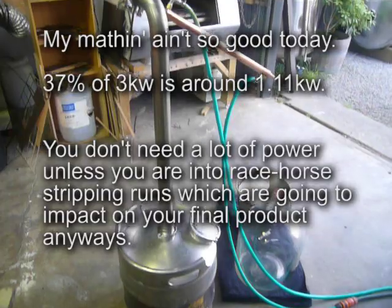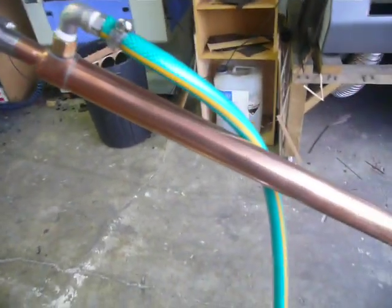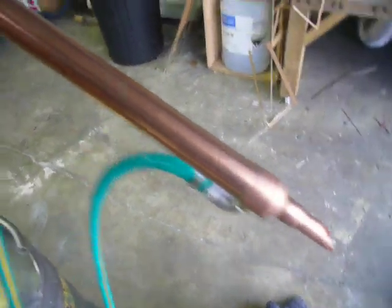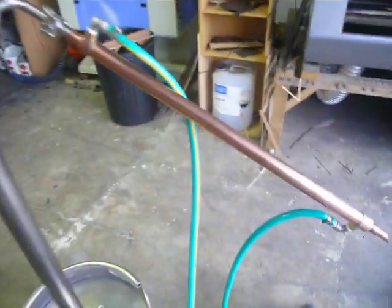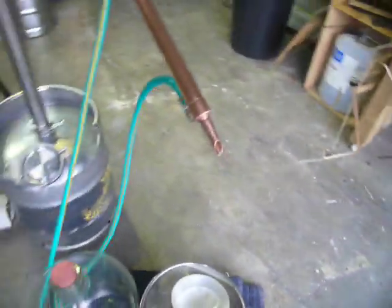You don't need anything flash. It's quite a neat little pot still and it does the business. It's just got a long condenser on there — a half-inch copper tube through the centre and a one-inch copper jacket. The jacket is only 600mm long, so about two feet long, and that's plenty to keep this guy running cool.